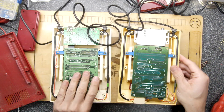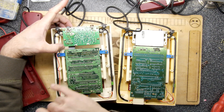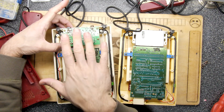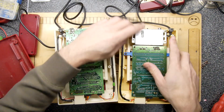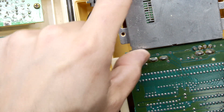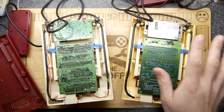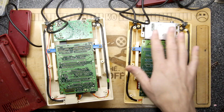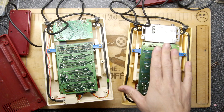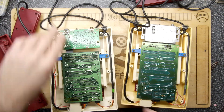This is fantastic because I get to show you both kinds. On the left you'll see the modulator and power supply board is totally separate — that's the best arrangement, making your life easier. On the right it's not as good because there are very heavy mounts for the modulator can. I suspect there was a problem with emissions — in fact some famiclones in the 90s had a little antenna on the back that would beam the picture to your TV antenna input, showing how much RF radiation was coming out of these.